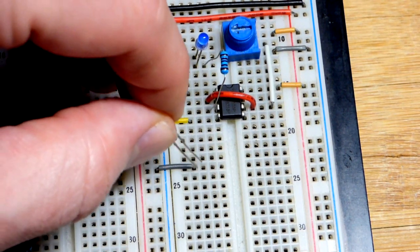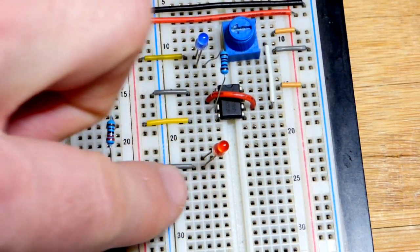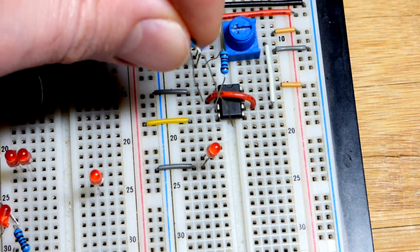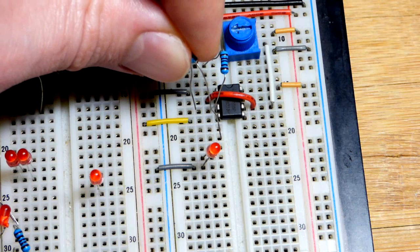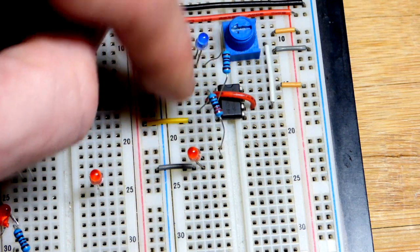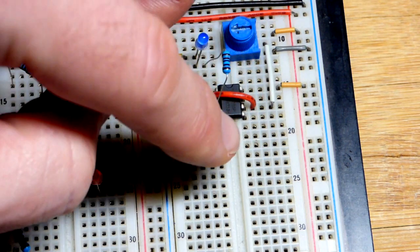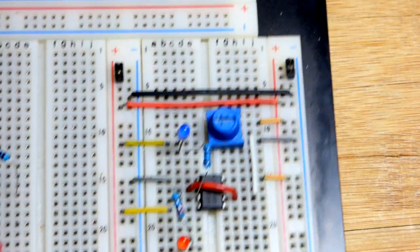Red LED, we're going to come down here, long lead the anode up one spot, short lead the cathode down one. We got to the jumper there. Again, the order of the LEDs and the resistor doesn't matter. Sometimes I have from the output showing the LED to resistor, but resistors are more flexible than LEDs for putting on the breadboard. So order doesn't matter as long as the LED is in the right way. So we got the LED down there. So that is it for the circuit.